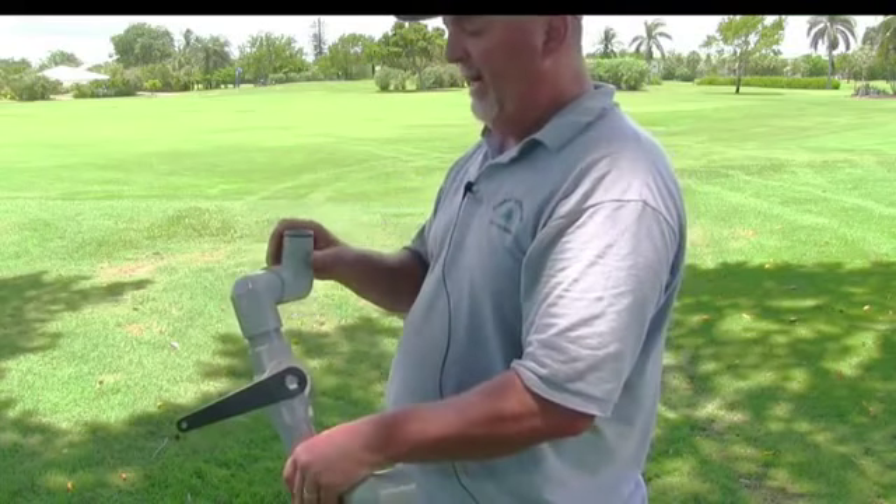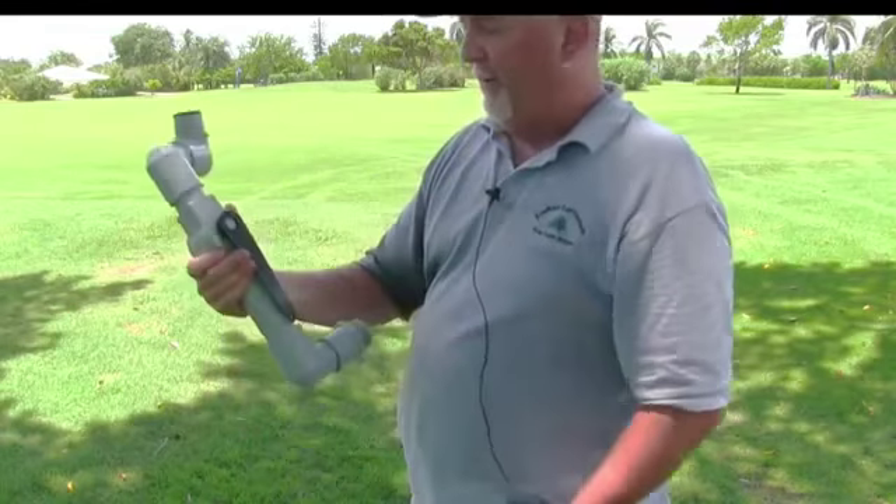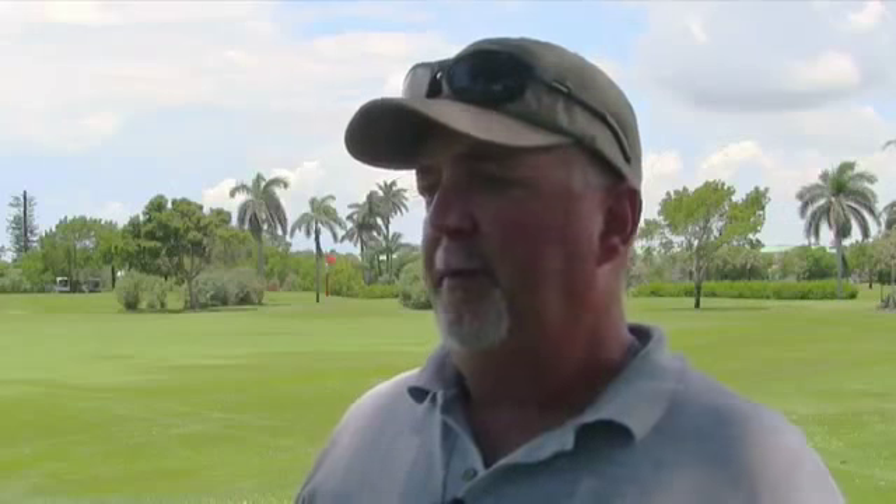You can spin another head on, wire it back up, turn this valve, put it back down. Now you've got water coming back through this valve. If you were able to keep the pumps running and just dig up the head, shut the valve off — all your other heads are going to work except for that one you just isolated.